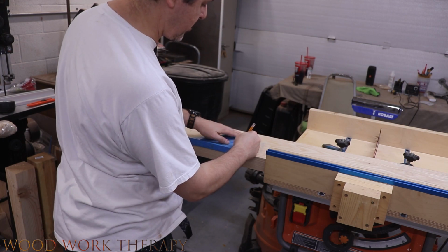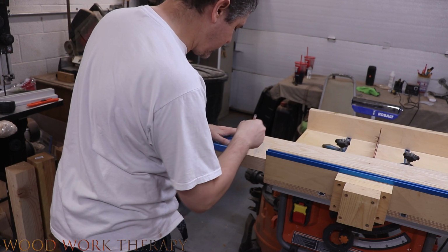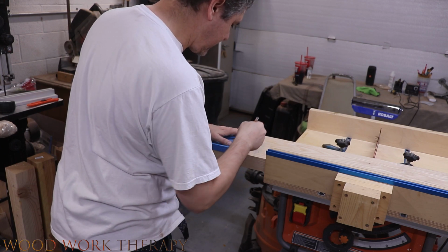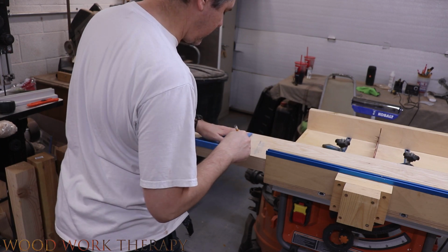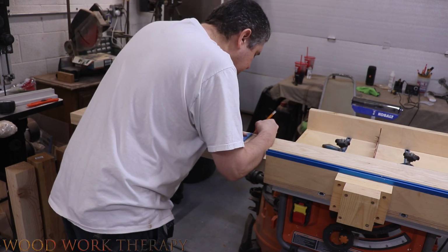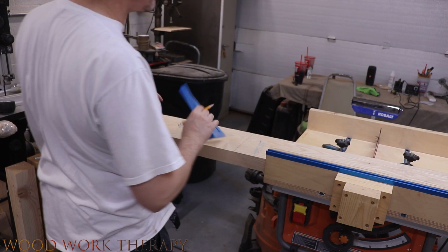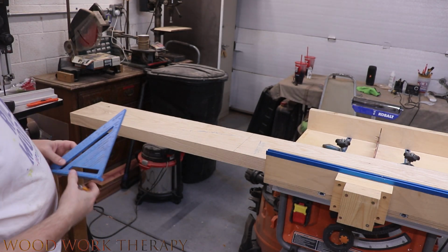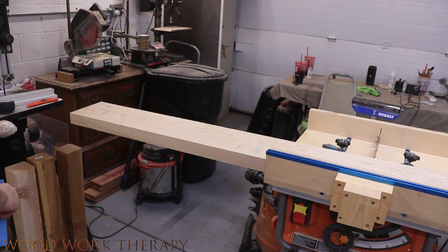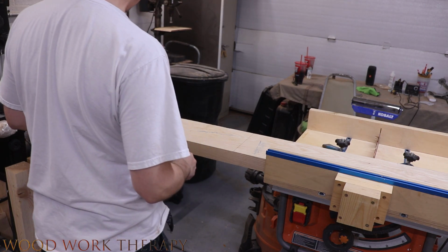So we want to make sure that we have a good table height for them. So let's just make it a little bit shorter than you would probably make for an adult, by about 1 inch. That includes the tabletop, because after everything's said and done, it'll probably bring it to about 29 inches tall, roughly, which is normal. That's good, about 30 inches tall, give or take. Depends on who you buy it from in reality.